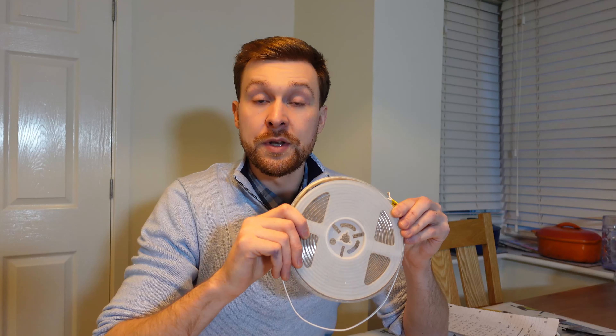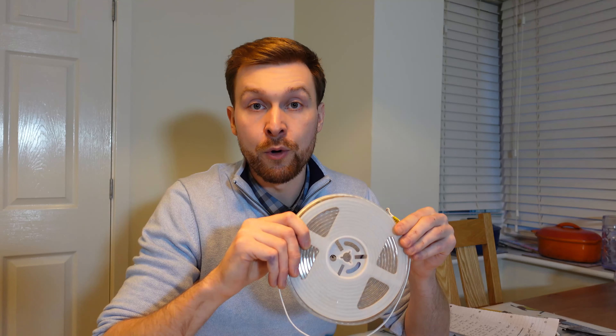For example, these are 10 watts per meter. I'm going to be running 5 meters, so I need to make sure my power supply can provide at least 50 watts — there's no harm in having more. Links for all these products can be found in the description. Well, that's enough prep work, let's get building.